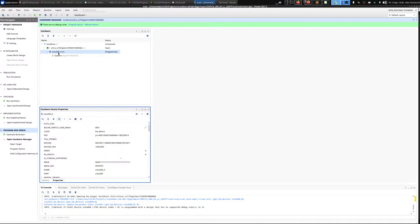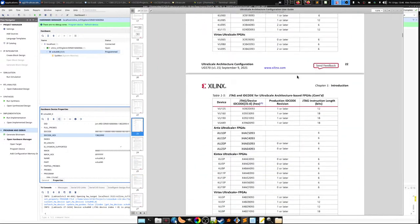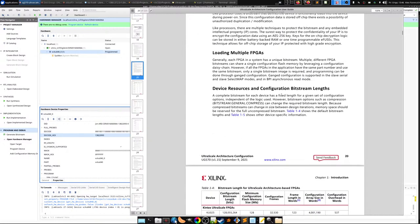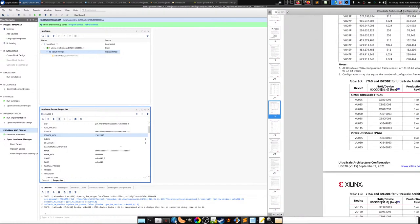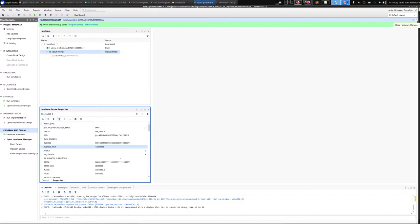From the Vivado hardware manager and the Wayback Machine research, we've learned several things: we have an XCKU040 in an FFBA1156 package, probably speed grade two, and it starts up in BPI 16 mode. The Dini Group website also showed they can stuff four different devices on the same board: the 035, 040, 060, or 075, all pin-compatible in that package. The UltraScale product selection guide confirms all of these are pin-compatible in the A1156 package. We also identified the DDR4 SDRAM and RLDRAM parts using the BGA decoder.